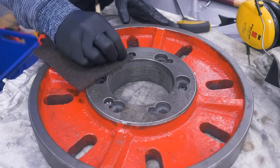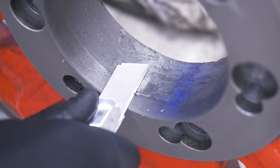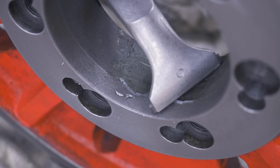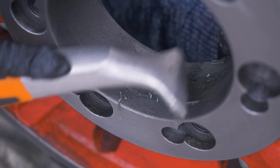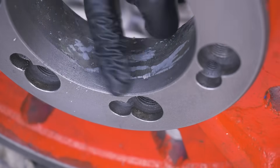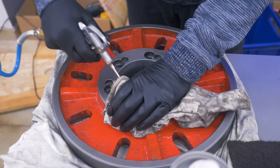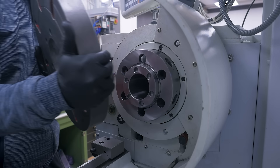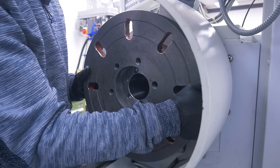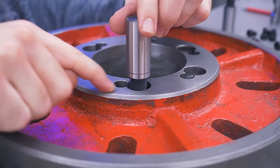Other than that I didn't clean the faceplate too much since I'll probably just re-face it when I need it. I made sure the interface surface is properly clean. There was some wax or similar on the short taper that I had to remove — maybe leftovers from manufacturing. So it's quite possible this faceplate has never been used before. Let's see how it fits — looks good.